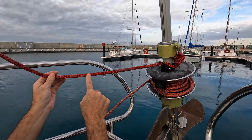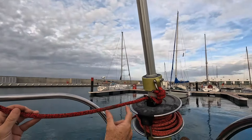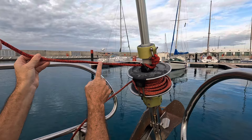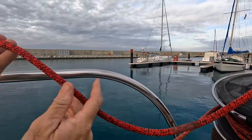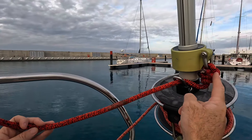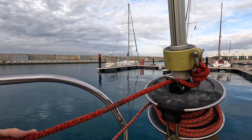Here's a good clean line, and then this is where the pulley sat. This is our furling line that comes through the mast all the way to the top where the pulley sits — and it sits there for the entire sailing season. This is where the wear happens. You can see the line is kind of flattened — no longer round. We'll cut it back; only lose about a foot. That way every season we don't lose our halyards — that would be a mess.